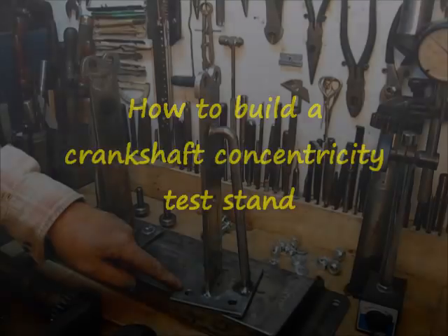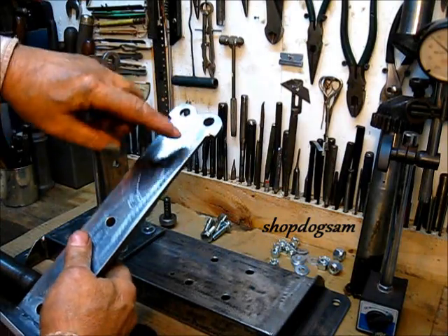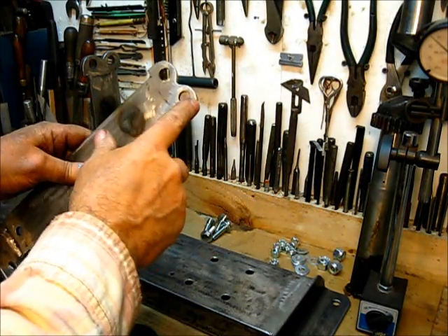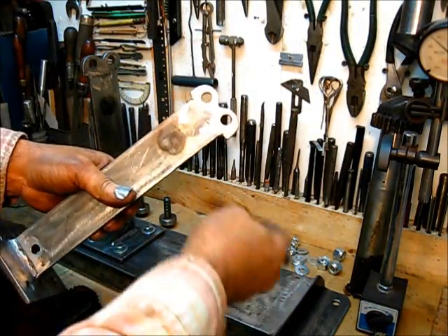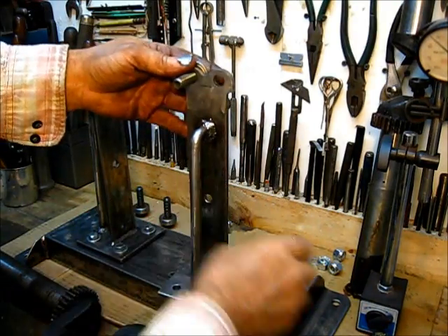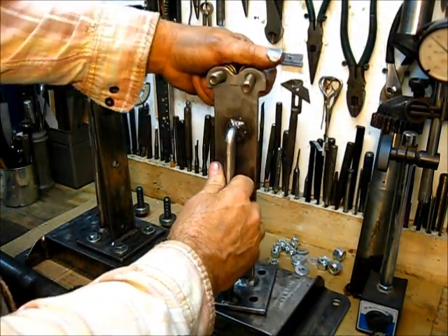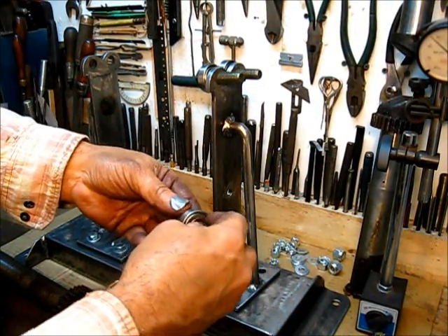The way this thing is going to work is these uprights right here — I've already welded that one inch by two and a half across through there, drilled half inch holes in them, and then just kind of freeform that around there in order to clear that bearing's outside radius with ample clearance. When you put both of them in there and look from the back, you can see it's got a lot of clearance.